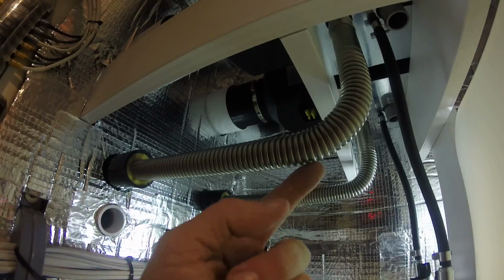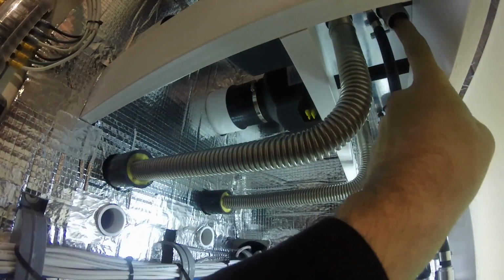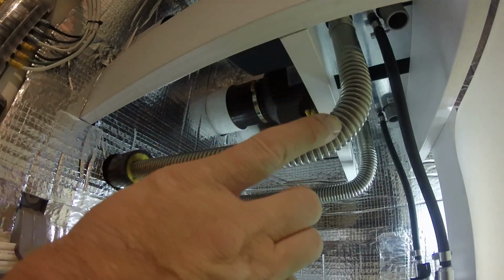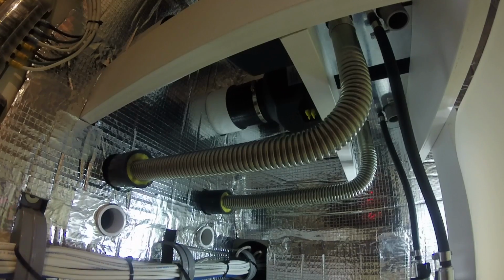Okay, the exhaust is here. The air inlets for the burner are up here. I have to use the same ambient air pressure for the intake that I do for the exhaust. That forces me to go outside. The exhaust is outside, so I just punched, saved a little time, did it off camera. Punched 2 more holes through the wall here, epoxied sleeves in, and I'll be able to insert the intakes for the burner now.